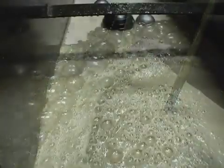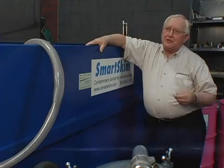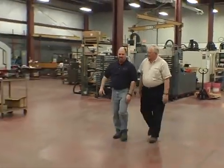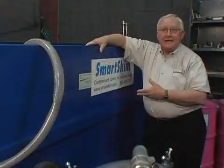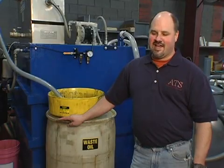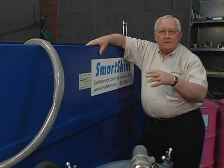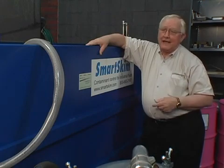Clean coolant is good for the customer in terms of employee safety. Tramp oil is a great breeding ground for bacteria buildup, and with our system we include an ozonator on the coolant recycling system which adds that extra element of oxygen, allowing for the breakdown of bacteria — hence a safer environment. It's amazing how many plants start out with clean fluid and expect their employees to stay there with dirty fluid, when it's so simple to maintain the quality of that fluid and extend its life almost in perpetuity. Our guys are a lot happier because they have a lot less skin irritations. You may have seen plants where you get a slimy, snotty-looking fluid — that's the fungus and the bacteria. You can smell it when you walk up to the plant; you won't smell that here.